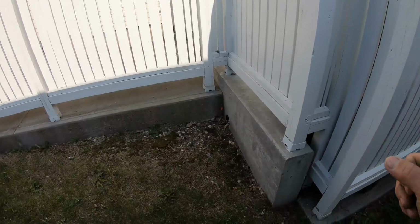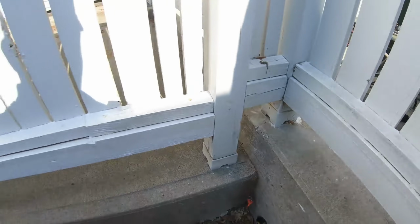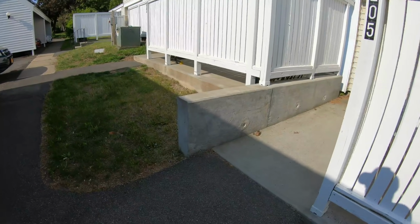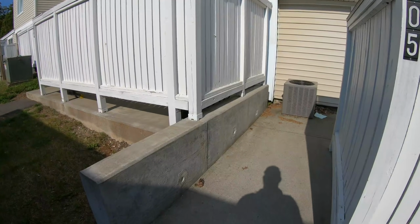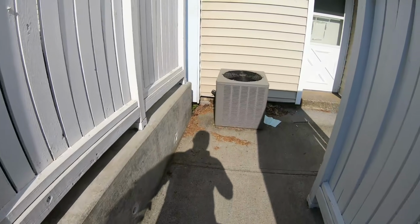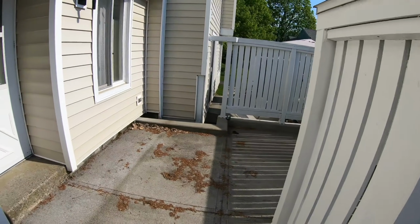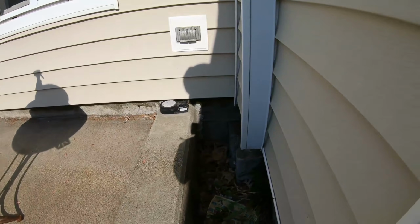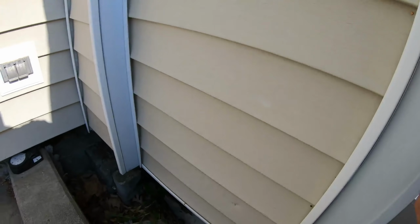But what's impressive is because of all the stone, there's a stub wall. This is the same kind of wall we're going to put in there with weeps for drains, and you can see there's no shrinkage crack at all, even against here. Nothing moves. Pretty impressive the way it's designed. There's another stub wall with the 3 weeps in it, and now this patio is almost 8 years old. You see how the walls are jogged, and they keep all this clear, and they fill this with stone, and this is where it was rotted on the one that we're doing now.